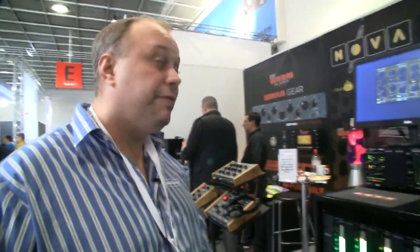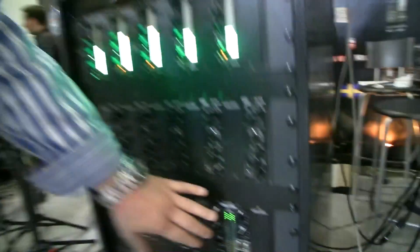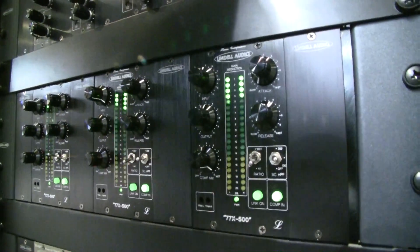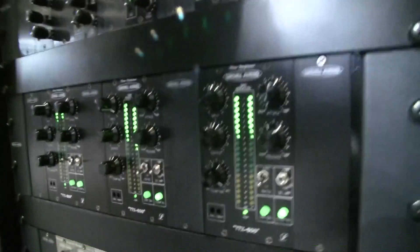This one is available now and retails at $750 US. Were there any challenges in getting a dual unit? The link circuit was quite a challenge, but we put in an actual battery inside the unit as you would with the old 1176-style compressors, and all the FETs are matched inside the compressor, so it's tracking very well in stereo.